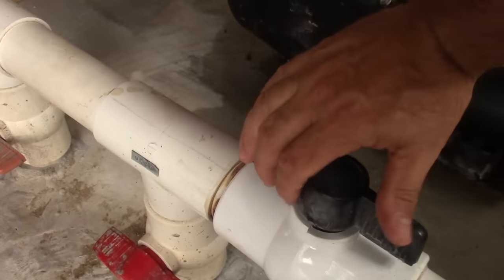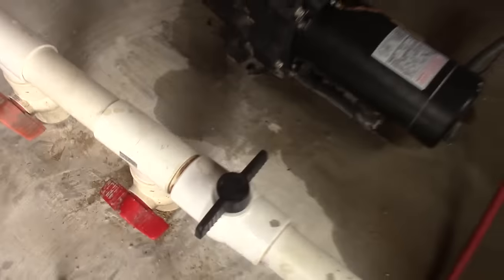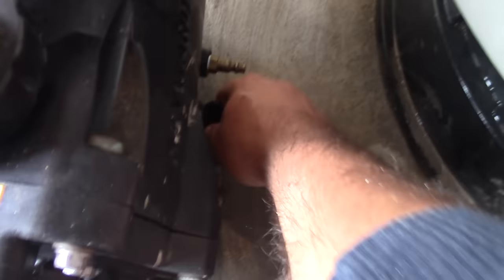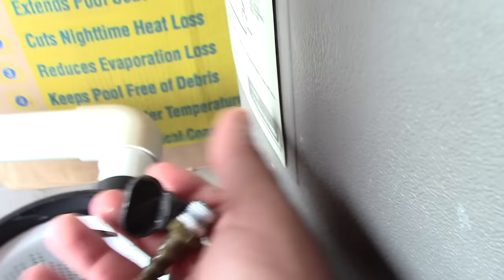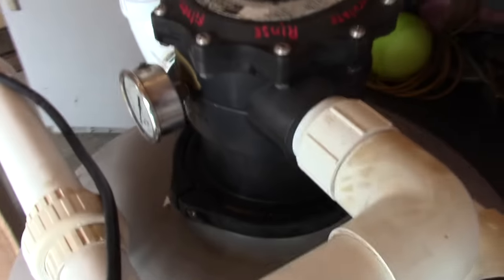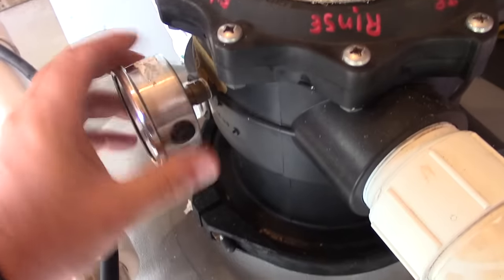Now all we have to do is create an airlock, and we do that by turning off this valve. We're all closed up. I'm going to pull out the pump plugs and the quarter-inch NPT fitting — I like to put those in the basket for next year. Then we pull off our gauge.